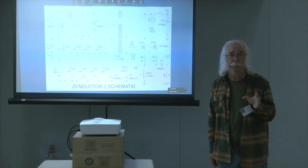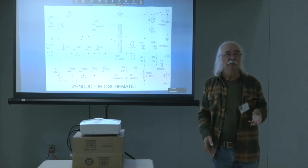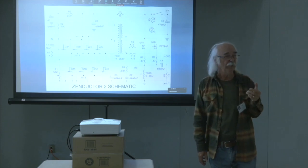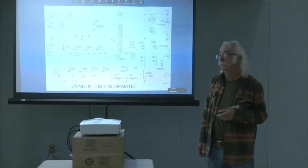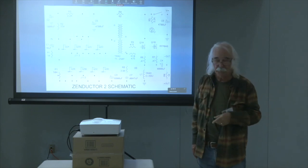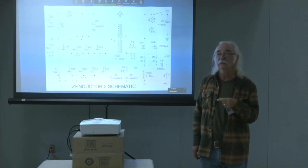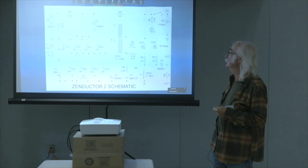We did several things. The most important is we operated the power transistors that drive the inductor as common drain. That is to say, they're strictly followers. In the previous edition, we made a single MOSFET do the double job of having both voltage and current gain. While it worked, in my book it was really good at 3 watts, and kind of fell apart slowly above that. But a follower has a much more specific job to do, and it's a lot easier, so it can deliver more juice easily without distortion. This one goes to 10 watts, depending on how high you decide to bias it.